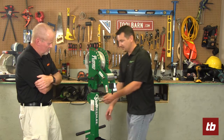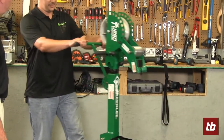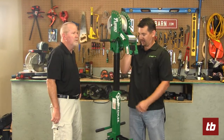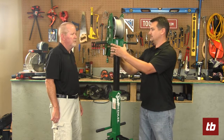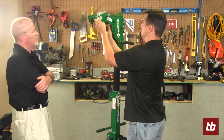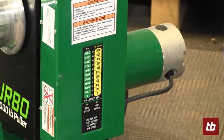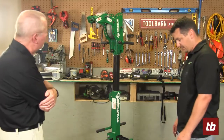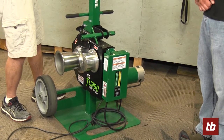It's a one-man operation and only weighs 240 pounds. With this rotating handle, it rotates back just like any other hand truck so it can be moved around pretty easily. The handle can be moved out of the way. The boom here — with these captive pins you pull them out, the boom can be extended up and set into place. The head can also rotate one way or another, so you can do an up pull, a side pull, or a down pull. With the captive pins you pull them, rotate your nose, and then clamp on the conduit. It also has a force gauge on the front which shows you the force of the pull as you're starting it. It's also foot-pedal enabled — with a double tap of the foot pedal you can go from low speed to high speed. There are dual caps depending on the forces and how fast you want to do it.